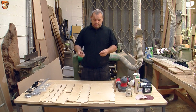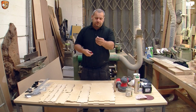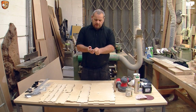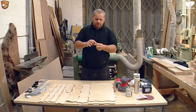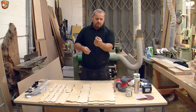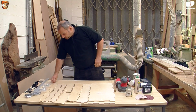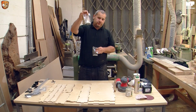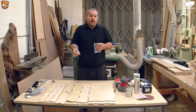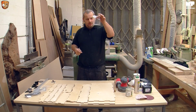And also these are a little bit extras, but these are what you can use, as I tend to put in my cases: a 10 amp rated switch, a 5 amp rated Switchcraft DC power inlet, and these things are called Wagos, which are little distributors, which are really smart, really safe, and solve a very good problem, so you can star power your bus boards. And also one little thing, not much, but you actually get two different sizes of screws. One for your normal, which is 6mm, and obviously this is DIY, and in the spirit of DIY, we use a lot of thicker face plates, so I've got 8mm ones as well.